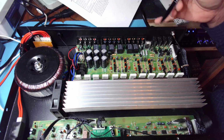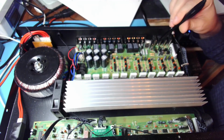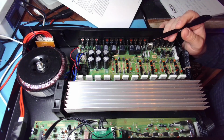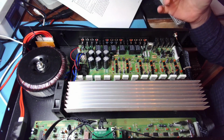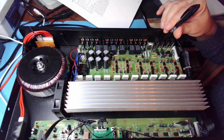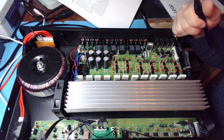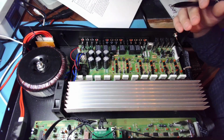And is there anything? Well, the radio works pretty well. Obviously, you get more power on these additional inputs over here, as opposed to Bluetooth, and this seems to be common for all the Pyle devices that I worked on. You get amplification obviously, but the input signal is so low that you can get a lot more power from it when you deliver the signal through the cable rather than Bluetooth. That's probably because the maximum amplitude of the Bluetooth device is probably 3.2, 3.3 volts. So that's a pretty weak input signal. So obviously, you can't overdrive it.